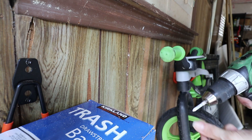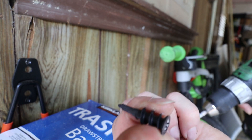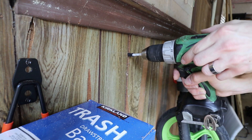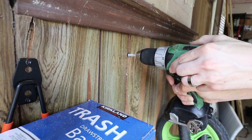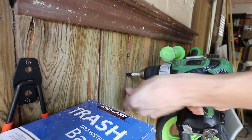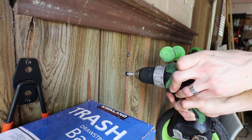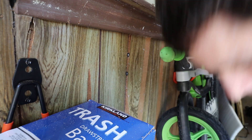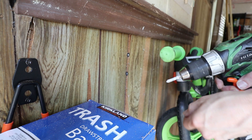Now that I've popped it through with the number two Phillips, these are self-tapping sheetrock anchors. I'm just going to stick that in the hole and pop it in place — just snug, not over-tightening it. Same thing down here, just snug. Then grab my Phillips screw.